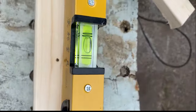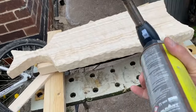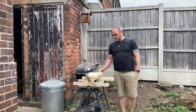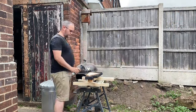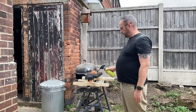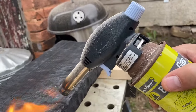Now over to the burn station that I've made, just making sure it's level so that hopefully it doesn't warp the wood too much when we actually burn it. This is the fully textured board. And now for the fun part — the fire. Just a cheap butane torch that I got off Amazon — I'll put a link in the description. The key is you want to get a deep burn, but you also want it to be even all the way around so the wood does not warp too much. For future reference, you're probably better off doing this on some sort of stone rather than wood, because the wood I used actually burned quite significantly as well. You want to get the wood glowing and hear it crackle, because that's what creates the alligator scales.